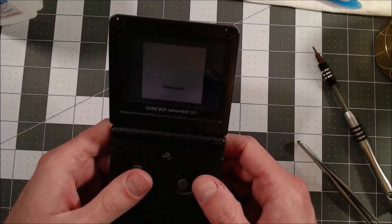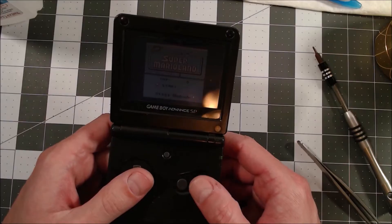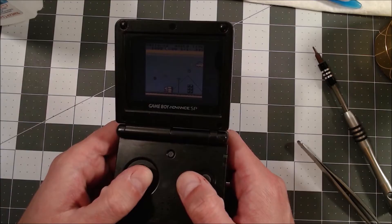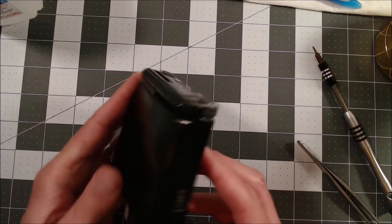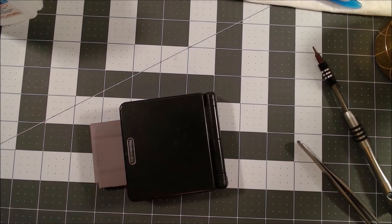We are reassembled and everything's working like a charm. I'm going to buy a replacement battery and call it a day. The lesson here is one that can be quick to forget — to always start with the simple things first. When I visually checked the battery it seemed fine; it wasn't bulging or anything, so I didn't think much of it. When really that should have been the first or second thing I tested, alongside cleaning the charging port.